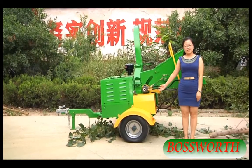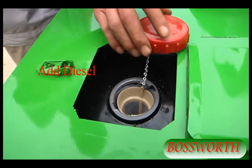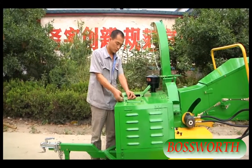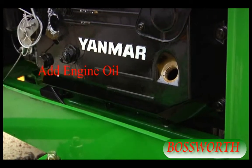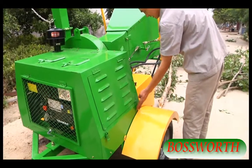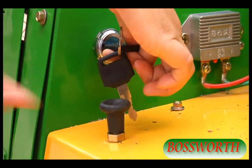Model RSD WC22. Add water, add diesel, close these two protectors. Add engine oil — now we check the engine oil about this degree. Close the canopy, now add hydraulic oil and accelerate. Start the engine.